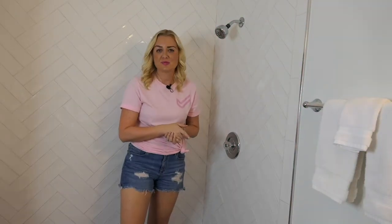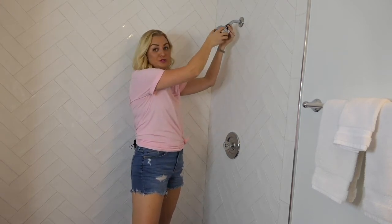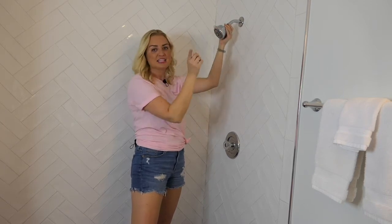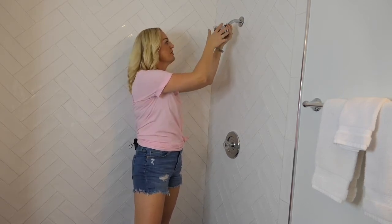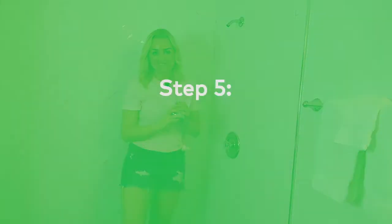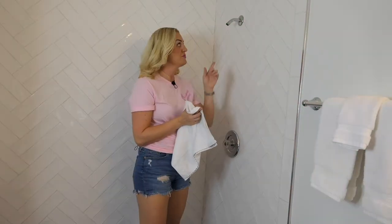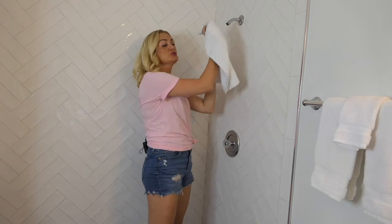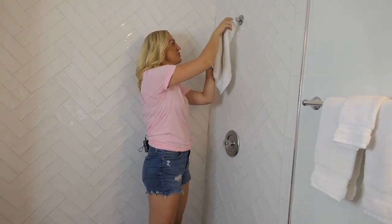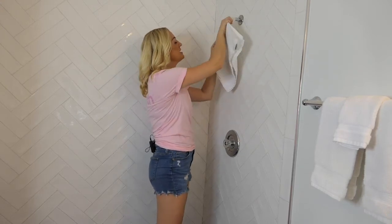Now that our workspace is prepped, this is the fun part. Hopefully you have an easy time just being able to remove your shower head like this. If it's screwed on a little bit tightly, that's where your wrench comes in to help you get it off. You can also use your pliers to help remove it — but just remember, every shower head is different. Now you'll want to clean off the shower arm threads. You can do this with a clean washcloth or a toothbrush if you want to be extra thorough. Make sure you remove any residue from the old tape that was on there.